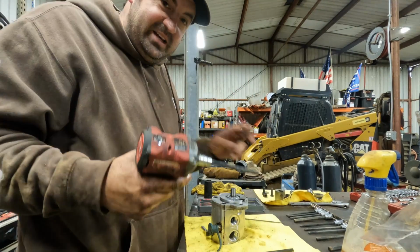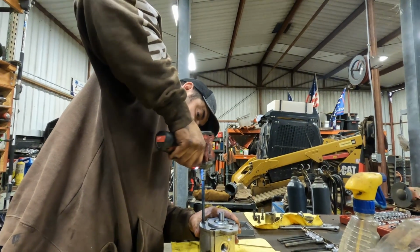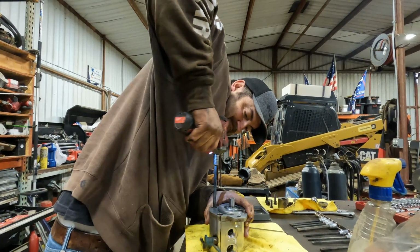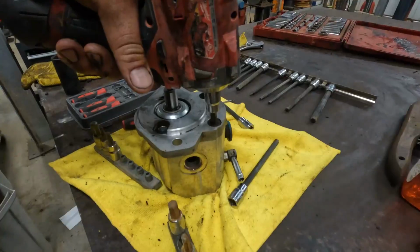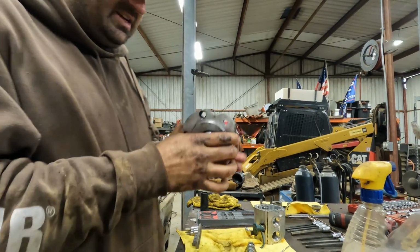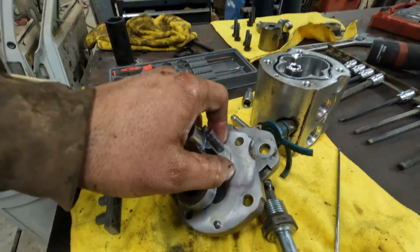These ones were not as difficult as the two that were holding it to the fan trap. I stand corrected. Come on. Man, come on, let's go. Let's go ahead and try a shorter one. Hopefully it's not gonna dance around as much. And that's the wrong size. That's all she needed. So I'm pretty sure I found where the leak was. Check this out, guys. Look how loose this is. Definitely not supposed to be like that. So once I get all this taken apart, we'll go ahead and replace the seals that are inside there. Then it's just time to put it back together.